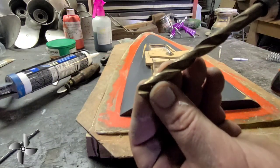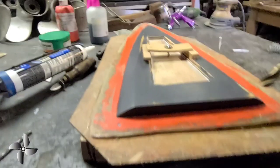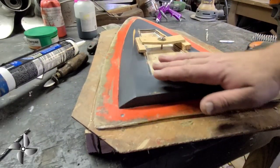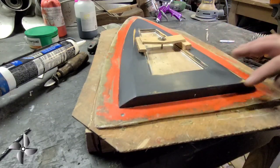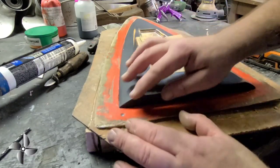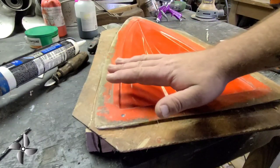What you do is take a 5/8" bit and drill into your mold — go in about four or five millimeters, not all the way. That's going to give you something to line your two molds up when you're done. Drill them all the way around; resin will seep into that little valley and give you a notch on the top side of the mold so you can line your boat up when you go to glue it together.